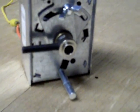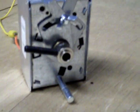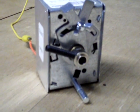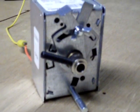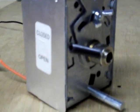We're not going to get into the adjustments, the end adjustments, but you can play with this X here and adjust the open and closed positions. For now we'll just leave it set default — wide open, wide closed. So with power to the zone motor it opens. Of course I said that backwards — it drives closed and springs open.